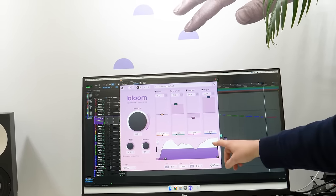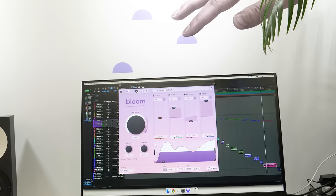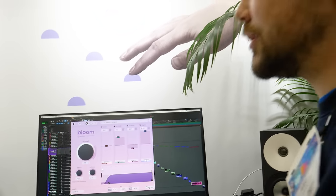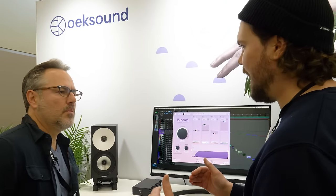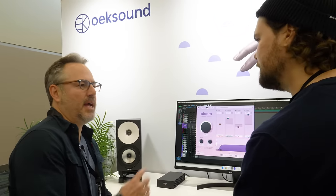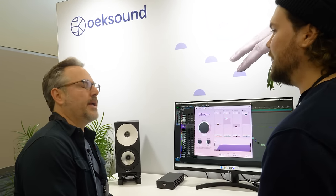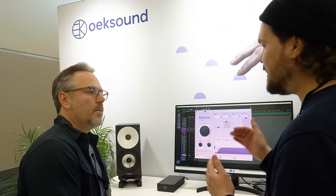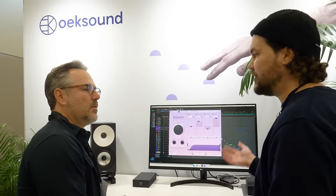But on sibilance, you see, it cuts down. It doesn't boost the sibilance, because I hear that. It's constantly taking into account the total frequency balance that's going on. So if there's a momentary spike at 6K that's obnoxious, it's throwing it down momentarily, because it's like, this doesn't need more than 6K because it's boosting that a lot, the sibilance or whatever.